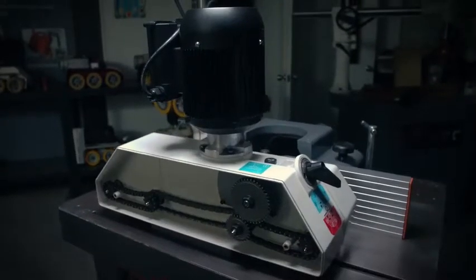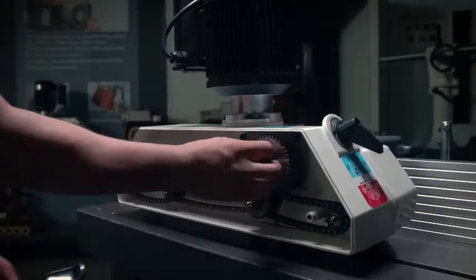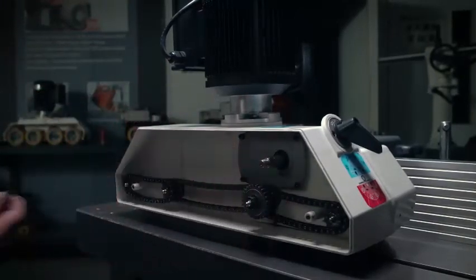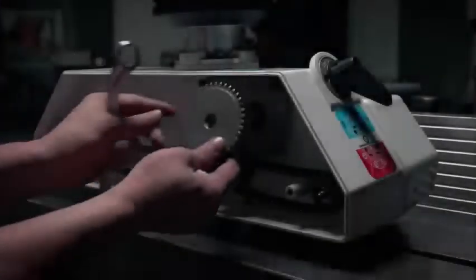For AF series power feeder, remove the cover in case of abnormal conditions. Remove a drive gear and examine the driving system and replace any damaged parts. In case of a motor failure, please contact us to find a replacement.